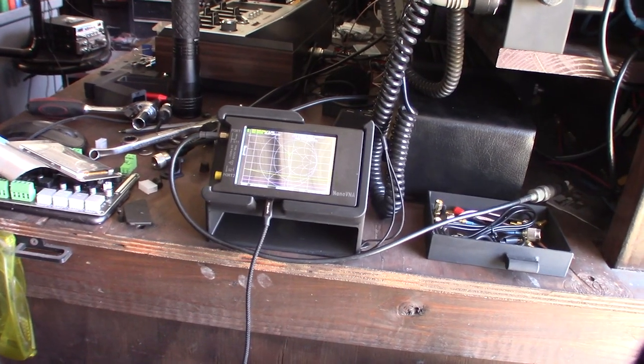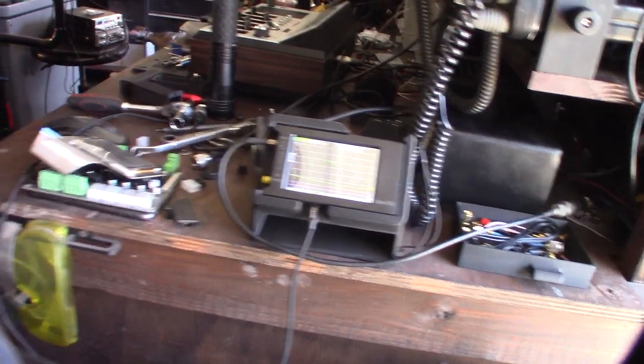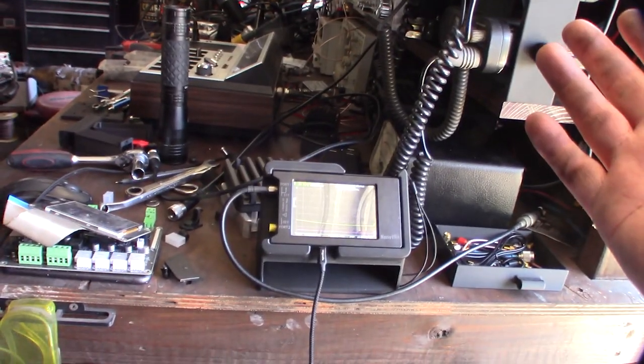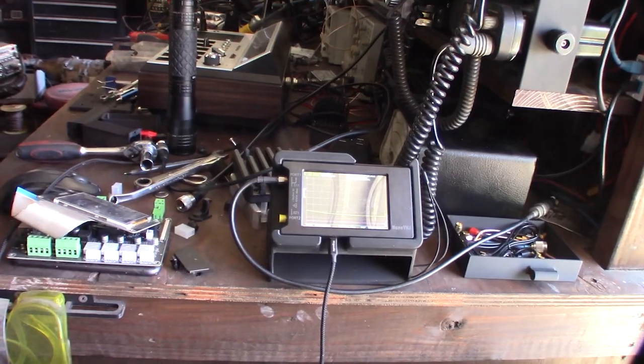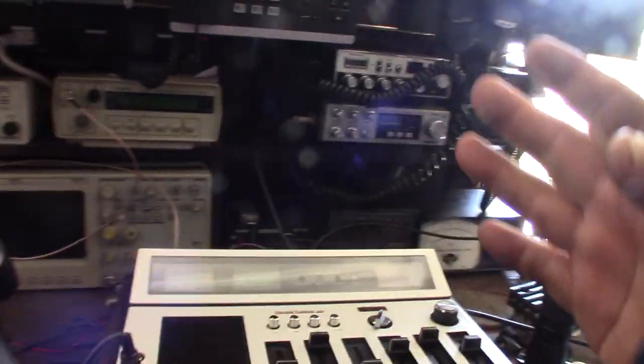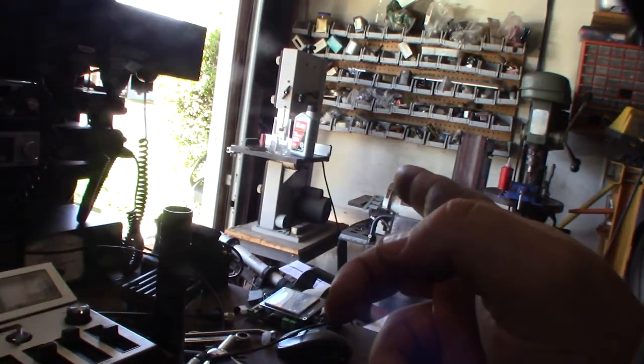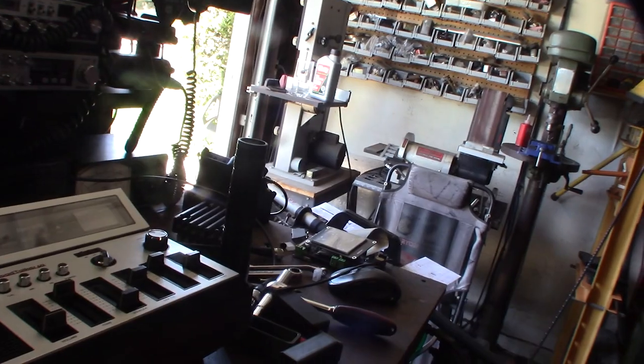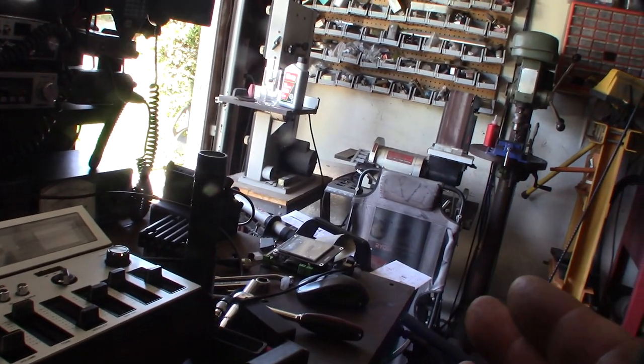Alright, so I'd like to get it at 1.1, obviously. But I was up there adjusting the different lengths, different angles. What's weird is, it changed. I know I have a lot of power lines here next to me, but it changed based on the direction. What's funny is when I pointed it in this direction, I got the best SWR, but if I was pointed this way or towards the beach, then the SWR would go up to over 2. So what's weird is the direction that I want to point it in actually had the best SWR.